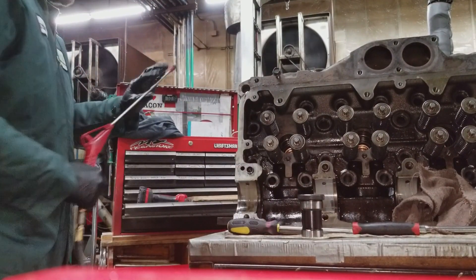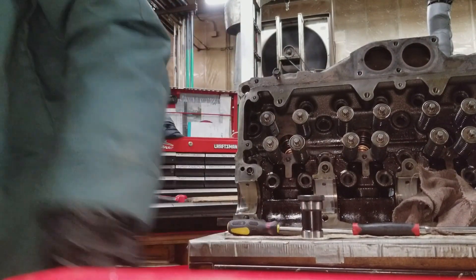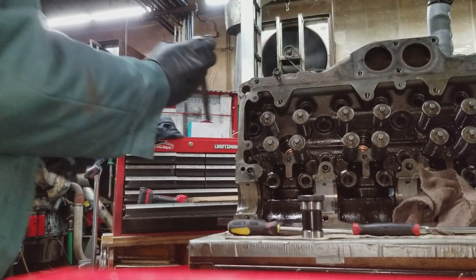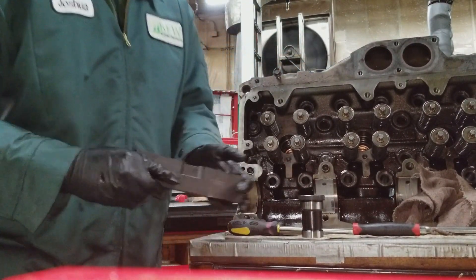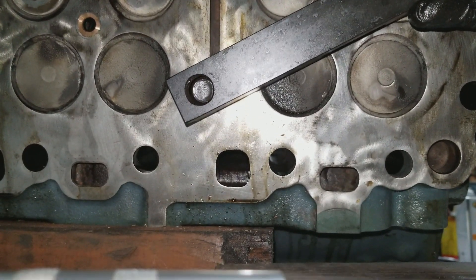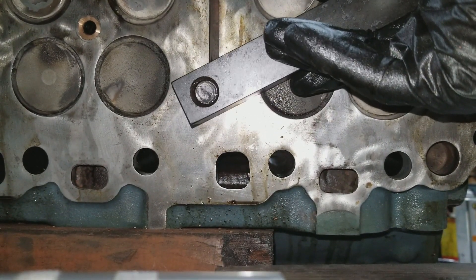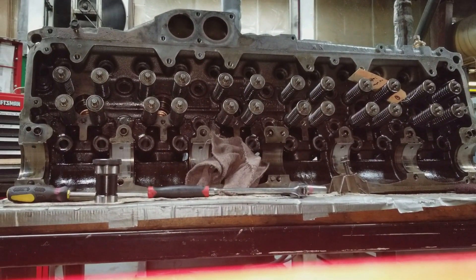It doesn't take much to clean that out. There are cutters on the bottom of that reamer which you don't want to hit the inside of the injector cup. When you feel it push through, go ahead and stop — you don't want it to bottom out. Now I've removed the dash-10 and we're installing the 3388-0-20, which is going to be the backstop for the injector cup reamer, or seat reamer. The seat reamer is 3388-0-1.